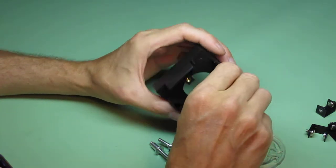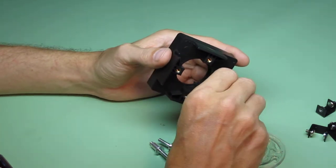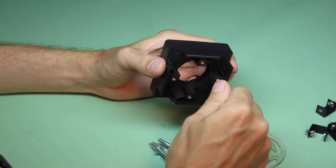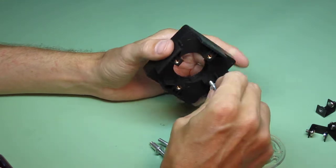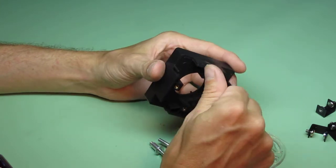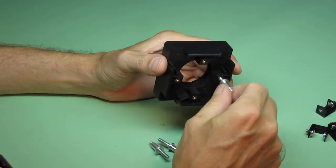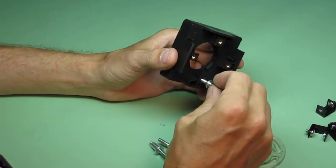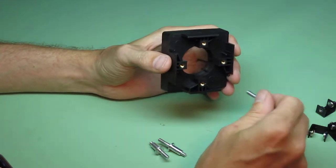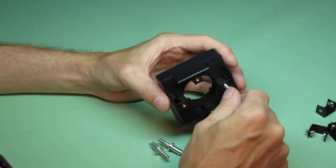Now, one of the problems that I've had is that these do not screw in very nicely. They're oftentimes very difficult to put in, and the material is just too soft, and it's not precisely engineered well enough to really screw into these holes very well. I've had numerous problems with these risers. The risers are necessary in order to get the circuit board to be the correct distance away from the magnet so that the sensors work right with the restrictor plate in.